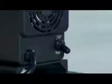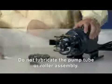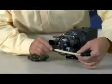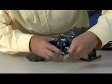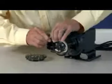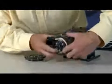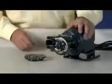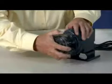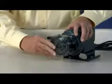Ensure the pump is off and the power cord is unplugged. Ensure that the feed rate control is set to 10. Place the new tube in the pump head and use your fingers to center it over the rollers. Place the tube housing cover, feet first, on the tube housing. Affix the front of the latches to the cover lid and then press the latches back to secure.